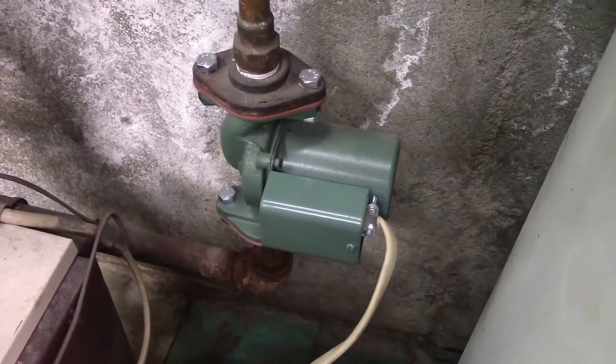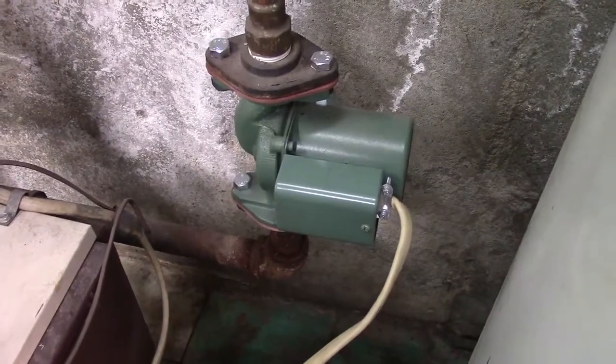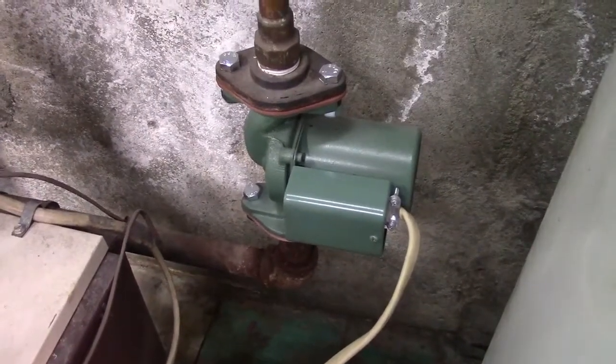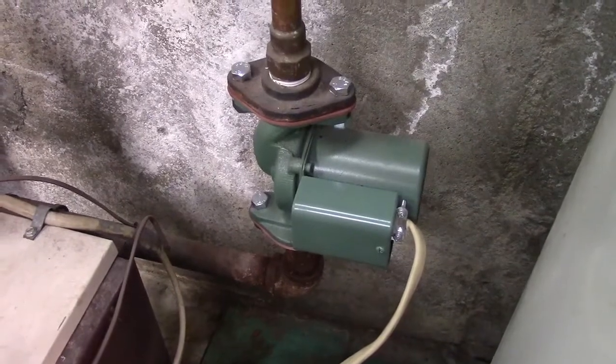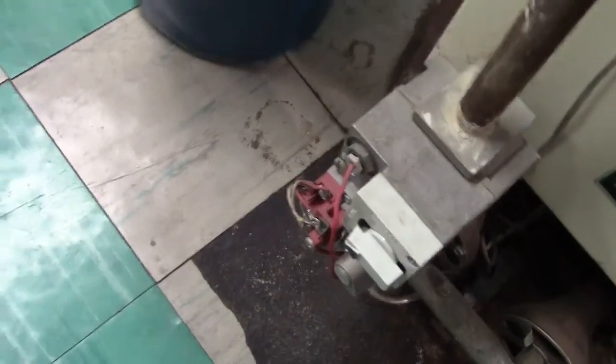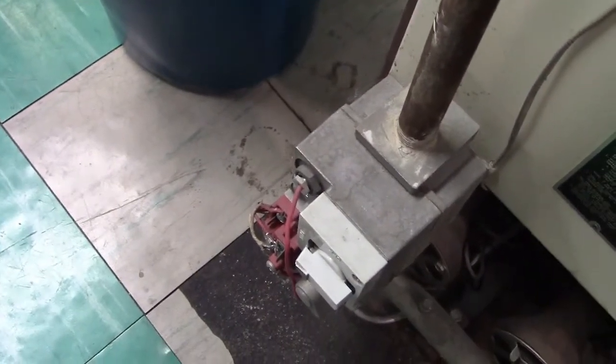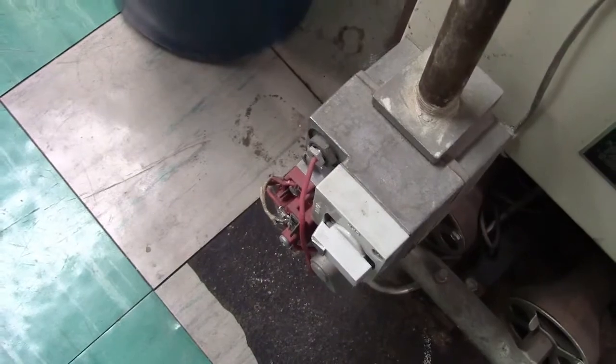The best way to do this is to take the cover off and wire them in, and drill a hole in the cover and actually mount it properly. Before we do anything else, let's get rid of some of the cobwebs here and kill power to the boiler, so I know it won't fire up. I'm also going to turn the gas valve to pilot and leave it there just in case.